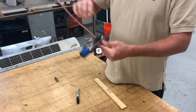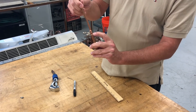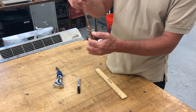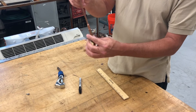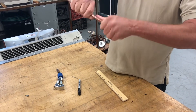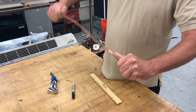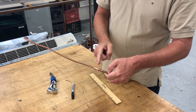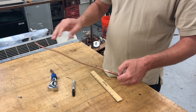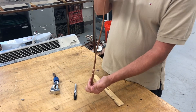Now we have a shelf — it's almost like a swage socket but it's not. It's a constriction, so it allows the solder to go down and collect in a pocket, and it won't let solder continue to run down. It also holds the pipe in place because it's snug. I could still force it out if I haven't constricted enough — and that's important, because if I go another turn we'd start to reduce the quarter inch pipe down toward one-eighth inch, which is not what we want. You just want to create this shelf and socket to have a good solder.